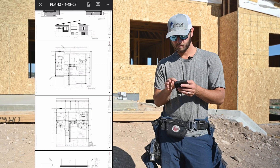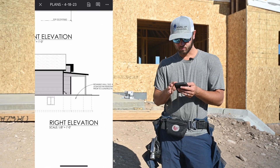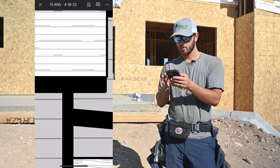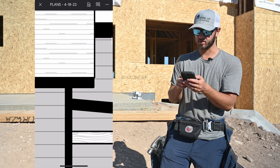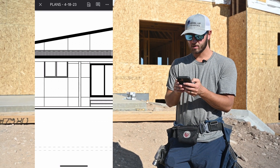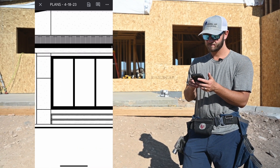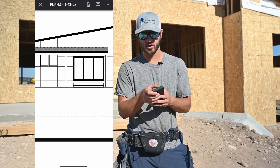Not a very long set of plans here. We got one view of the porch from the side. It looks like we're about six inches below the sub fascia right there — the top of our roof looks about six inches below the sub fascia. Here on the back, you can see the beam kind of covers that window, which is in line with the patio door on our build, and the bottom of the beam is just above that patio door.